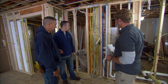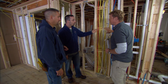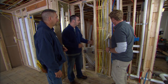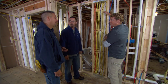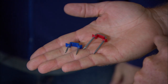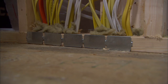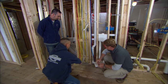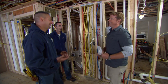What do you want to see as an inspector? I just want to make sure that it's properly stapled, neat and workmanlike. What is proper stapling? You can have a staple within 8 inches of a box or 12 inches, depending on the connection of the box, and then every 4.5 feet after. We tend to overstaple. Here are the actual staples we use — you can see one is red and one is blue. The red is used for two cables, and the blue is only for one cable. Down below here, we're using nail plates for physical protection. The sheet rocker comes in going quick, not looking for wires — they could drive into your wire and you'd have a problem at finish. That's why we're using nail plates.